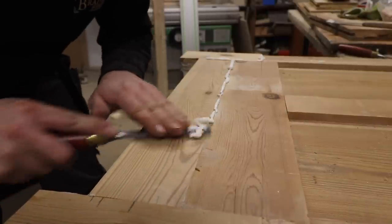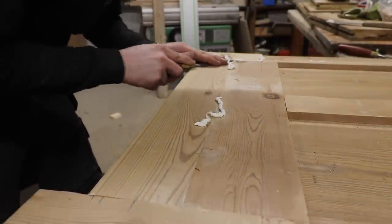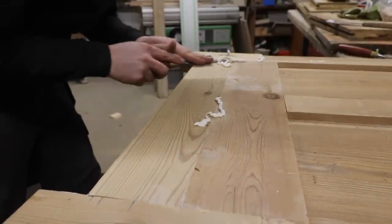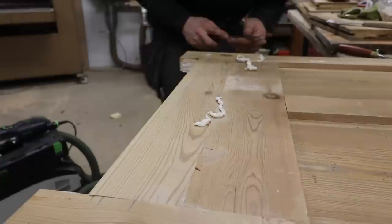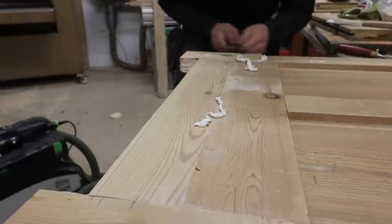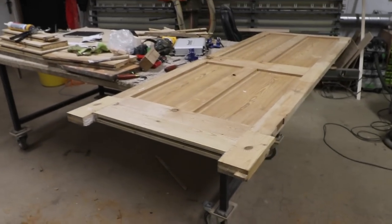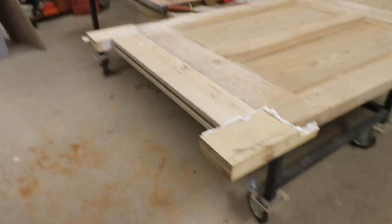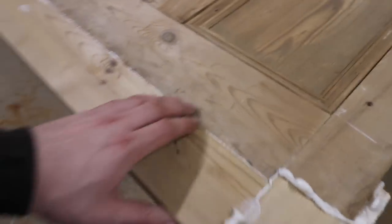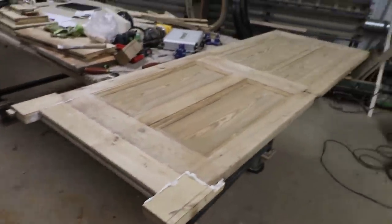It's easiest to clean this PU glue when it's dried but still tacky — at this point, before it goes really hard when fully dry. Looks like a proper bottom rail now. The underside doesn't look too bad either. That other door was obviously slightly thicker so it's going to want a little bit of planing and sanding down, but yeah, it looks good.